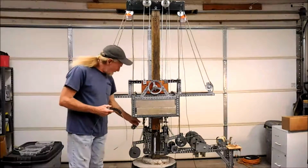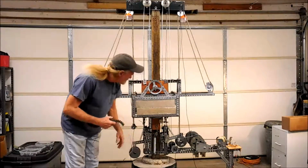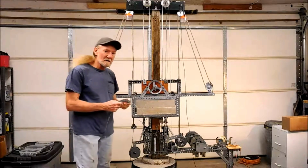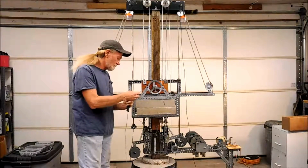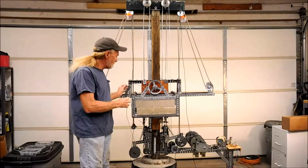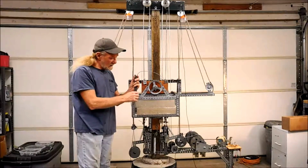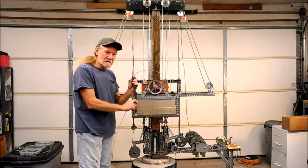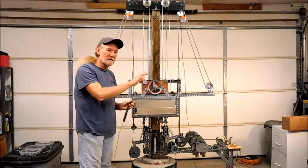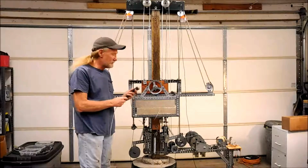On each side of the carriage, along the vertical support here, these projections and these projections here support the carriage whenever it's tilted back and forth by first pulling the cable up through a collapsed chain whenever it's tilted, and then whenever the carriage tries to come back down, it extends the chain and it locks the fulcrum position on the vertical support in place. And so successive tilts back and forth allows me to position the carriage and tilt it up the vertical support.